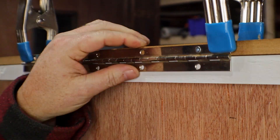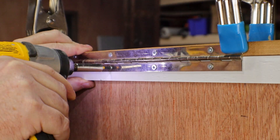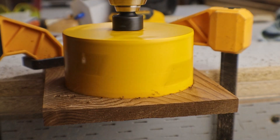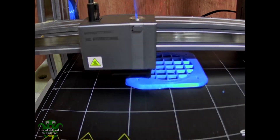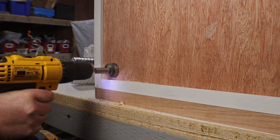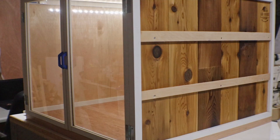The lid will also get some magnets to help hold it closed. That's the basic enclosure done, but this one will have a couple of extra features to make it just that much better. I am going to exhaust this to the outside, so I bought a hole saw for this job and thought I'd better test it out on some scrap first. I 3D printed a mount for the dryer hose and attached it to the side of the enclosure. I also drilled a small hole for some cables to pass through. One of those cables will be for the LED strip, which should make it bright enough for filming in there.